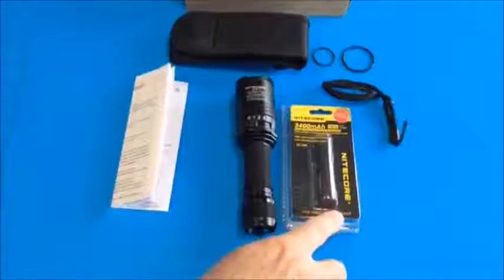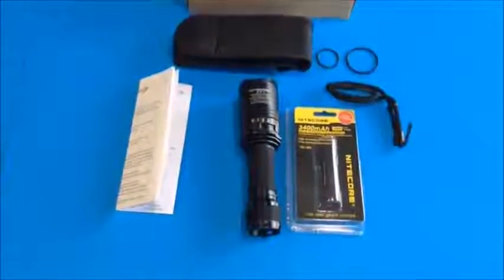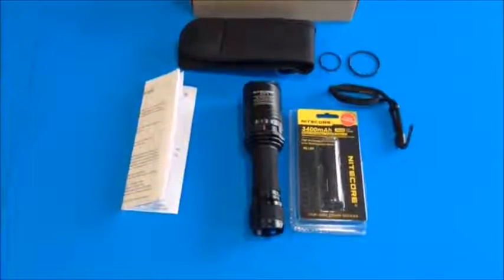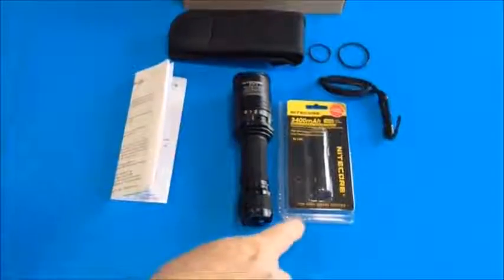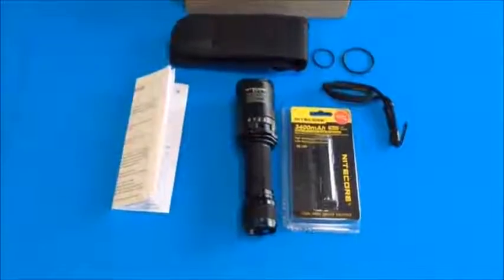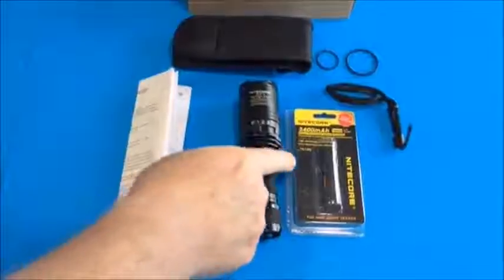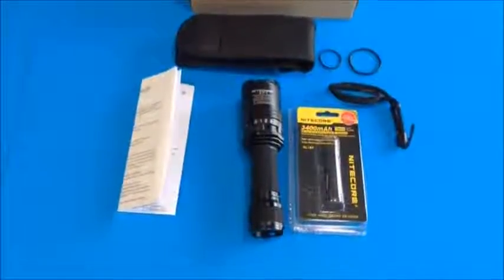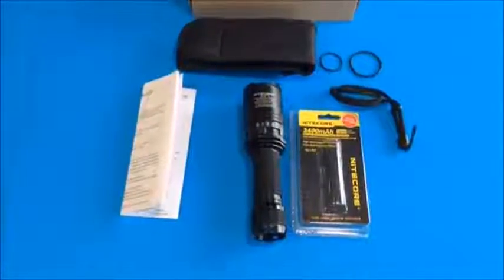It does come with 1 battery. As I mentioned, it's very powerful at 3,400 milliampere hours. It does not come with a charger, but they're readily available from multiple sources. Just remember, when you buy a battery, make sure you get one that's protected, which means it has the additional protection circuit board. And I also expect that you'll purchase 3,400 milliampere hour batteries, as they're very long lasting, and in case of emergencies you're going to need that capacity.